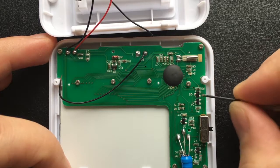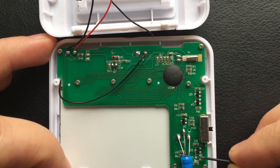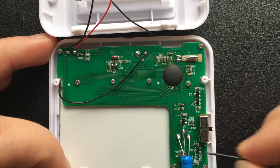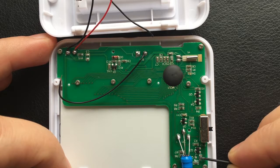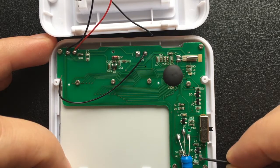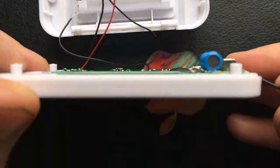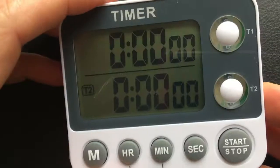There's a small capacitor here. One is for red, one is for green — the top one is for green, the bottom one is for red. As you can see, I already removed the green capacitor from the top timer, and now the green LED on the top timer doesn't flash anymore.